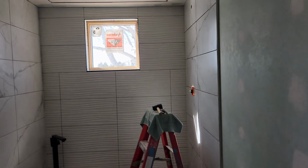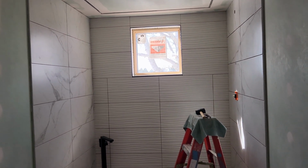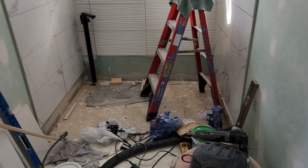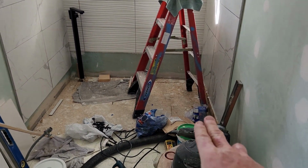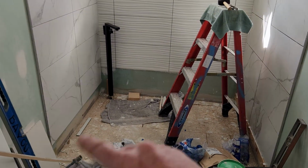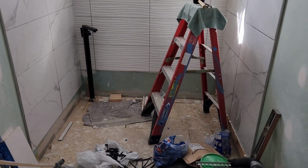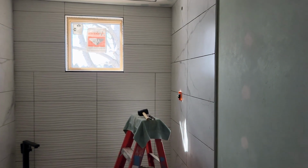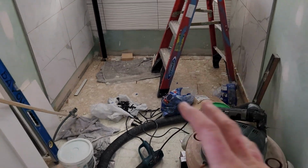So what we're going to do today is clean all those grout lines out, prepare it for grouting, but we can't grout it yet, obviously, because we still need to do our floor and then scribe in our last tiles, full tile here, small tiles down here and here, and we're still going to have to put on waterproof membrane, and we'll go through that step by step. But I want to do all the dusty work first. I'm going to put on my mask while I work those edges, because that is thin set dust you're putting in the air. And then after that is all done, we're going to clean this area up.